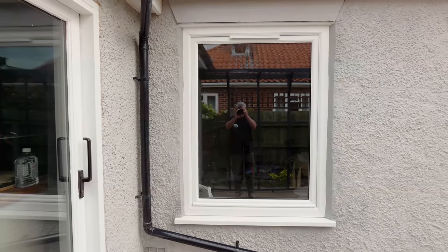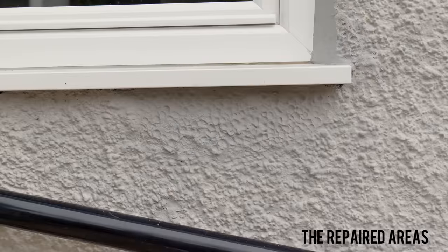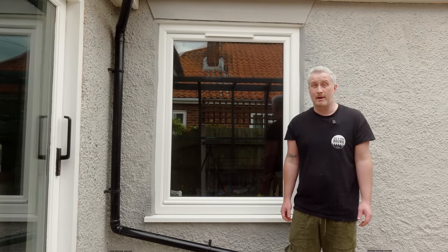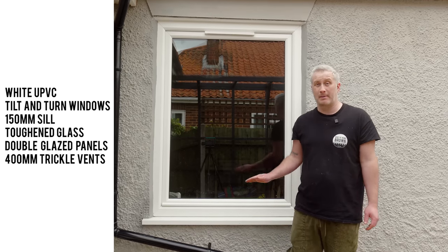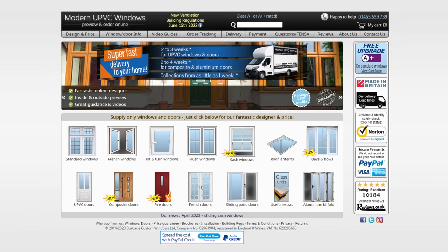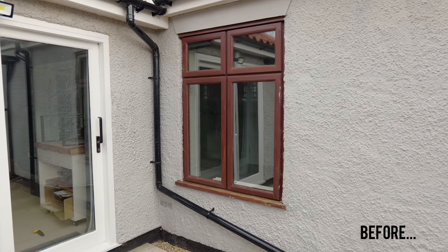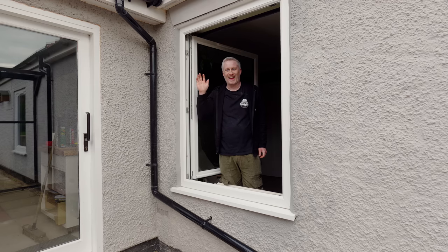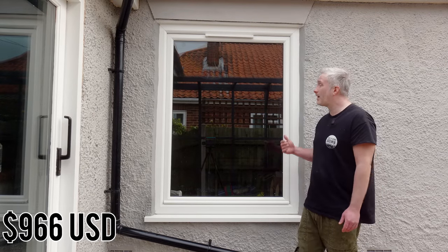If you're reasonably competent at DIY I'd definitely say have a go. It's not a difficult job, I actually quite enjoyed fitting them. These are the first windows I've ever fitted on my own, but prior to this I learned from my uncle who's a professional window fitter by helping him fit the two small windows that we put into my workshop a couple of years back. We bought our new windows from a local trade glazing company — I'll put the spec that I asked for on screen now. One thing to mention is that toughened glass is a requirement if the windows are within 800 millimeters of ground level. And if you're struggling with knowing exactly what to order and understanding what options are available, I'd recommend checking out a website called modernupvcwindows.co.uk — not a sponsor by the way, but I found their website really helpful because it shows all of the various options available and also points out some of the regulations you might not necessarily be aware of. The price we paid for both windows is £766, so about £383 per window, and I think that's a pretty good deal and we are really happy with these.